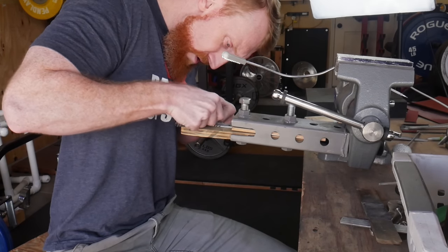After we get the excess material cut off from our bolt heads we'll move over to the 2x72 belt grinder with the 60 grit belt to start cleaning up the handles. I like to apply extreme pressure on the sides of the handle so that I can heat up the ends of the bolts — what this does is heat up the epoxy in the center of the blade and actually makes the epoxy bond a little bit stronger. I then like to apply as much pressure as possible to the knife when grinding so that we can burn the micarta. When you burn the micarta it actually makes it a little bit more dense at that spot and a little bit more resistant to wear in the future. So I try to burn my micarta as much as possible.